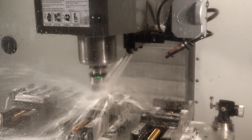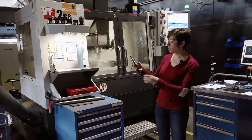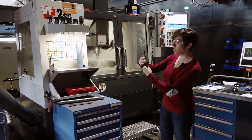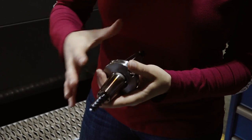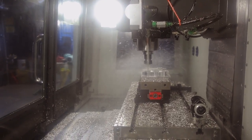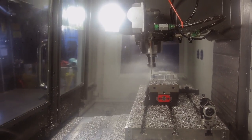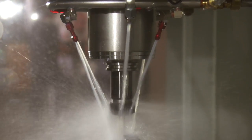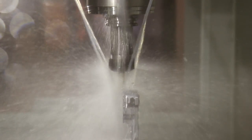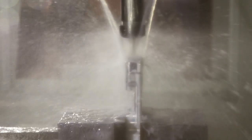If you want to take a closer look, what's going on with this mill is we have a tool like this loaded into this tall vertical spindle. It spins really, really quickly and this tool is really sharp. It spins quickly and then starts plunging in and moving around. All of that white stuff is called coolant. We have high-speed steel or carbide for our tool touching up against steel or aluminum, and that can get really, really hot. When things get hot, it will dull your tool, which will cause problems, and it can also cause the metal to warp and various things to break.